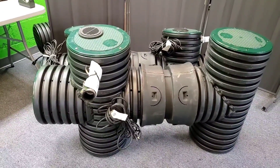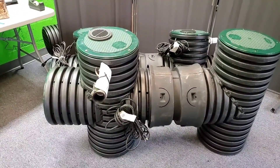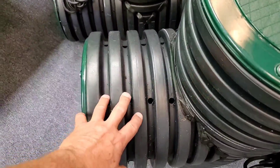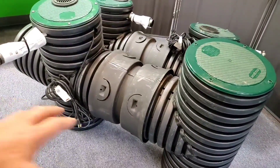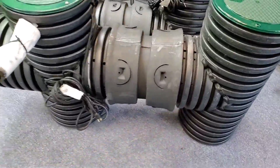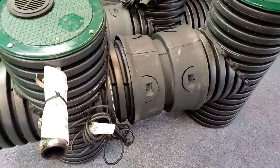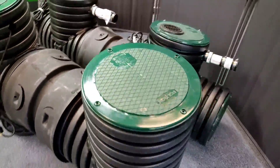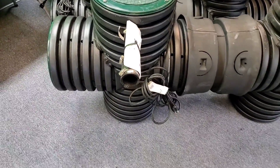There are no limitations when you're using our PVC from our store. There's an econ version that is white and stiff and hard to work with — or you can go with the black, which is very pliable and ten times easier to work with. It's inch-and-a-half Schedule 40, comes in rolls of 50 feet, seamless, leak-proof. Since we have these half-inch inlets throughout the whole system, the water just comes barreling in. You no longer have to tie pipes in and worry about connection points here and there. You can just lay all your pipes from your roof runoff, yard drain, and French drain systems right in the sump pit — it'll run right through the housing to the pumps.